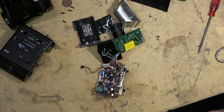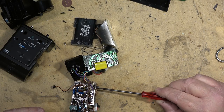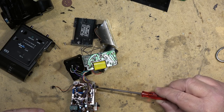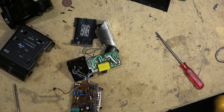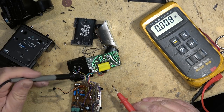2 amps is drawing. We should see a light start flashing down here momentarily if this thing charges up. It's drawing 0.8 amps now at 6 volts. Let's see if it will flash when I hit the test button. No, nothing going. Drawing 200 milliamps now, so it's still drawing some current, but this thing's not charging. And if I put my meter across the capacitor, see if there's any juice on there. So here's the high voltage cap.